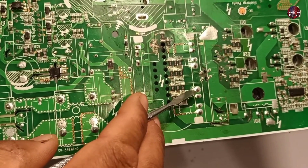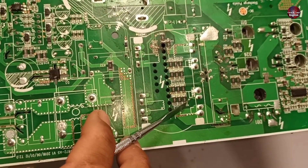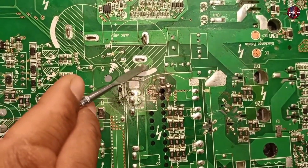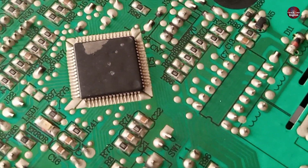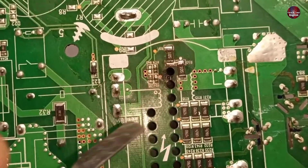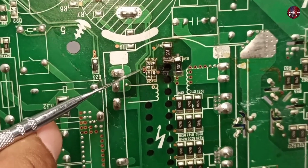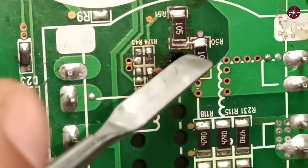In the circuit, one reactor is over here and the second is this one. To measure when this reactor charges and discharges, two extra coils are installed with it. Positive is taken from one side and negative from the other side of the capacitor trace, which flows towards the microcontroller as signals — to know at what time the reactor charged and discharged, and to make zero current detection possible, knowing which reactor is at zero and which is charged to maximum. I think these resistors were blown up.